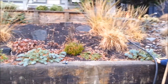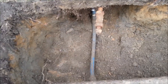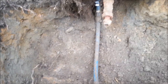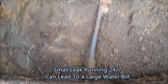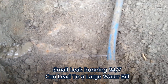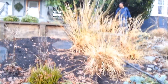We've exposed the pipe, the connection to the city here. As you can see, the customer has the blue poly. This pipe is notorious for cracking — it's a good thing he's having it replaced. The location of the leak on this pipe is on the blue poly prior to the city's connection. As you can see down there, it's spraying out. This pipe is approximately 25 years old, about the time we see them start to break.